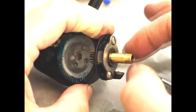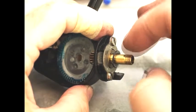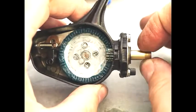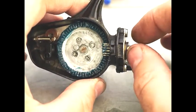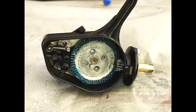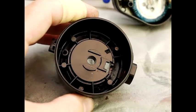which, as I said before, there's nothing to stop this coming right back out again until that through screw thread there is on. But that Teflon bearing will now turn, and it should turn your main cog. This is going to get oiled because it's a sliding part, and there's going to be some grease put onto this. Okay, so that's what your wheel looks like at this stage. Okay, so let's deal with reassembling some of the drum components.